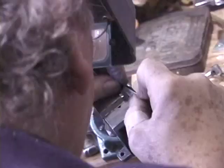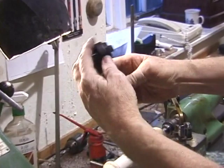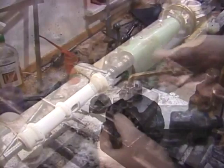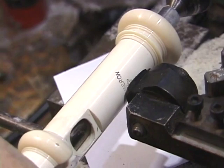Now again with the hand work, a little bit more lathe work. We're doing some little circular grooves there. And then one of the last operations is to put the maker's name stamp on there. The name stamp in steel is wiped or held over a lit candle to get lamp black carbon on it, and that will give color to the name stamp. So it's rolled in, as you see here, making sure that the name stamp is properly lined up, and a fair amount of pressure is exerted against the flute part, supported by the steel mandrel inside.